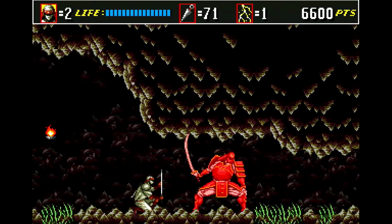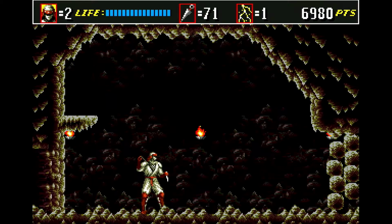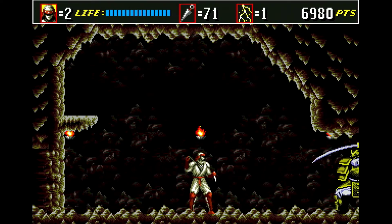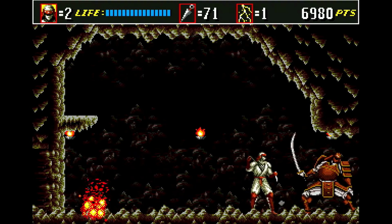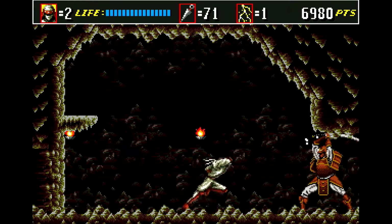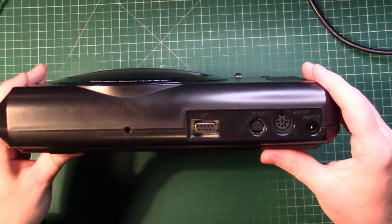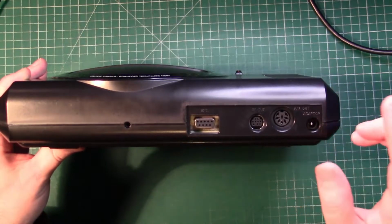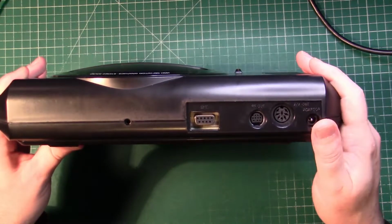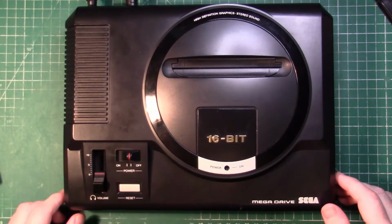I think the solution for the front headphone jack is to just get a nice piece of shielded phono cable and run that from the triple bypass board to the actual headphone jack. I'll continue to look in to see if I can tap the Sony stereo amplifier chip so that we can use the volume slider on the board, but that'll be for a future project.